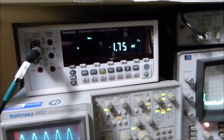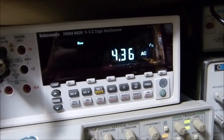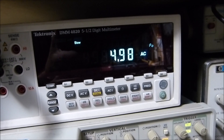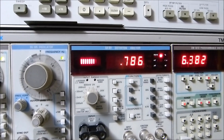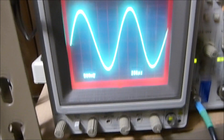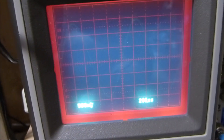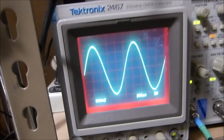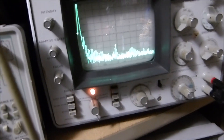Let's run it up to five watts. There we go — five watts, THD is 0.8%, and this is at 1 kHz of course. There's the sine wave — it just looks so good. So five watts at 1 kHz at 0.8%. The other channel does the same thing.